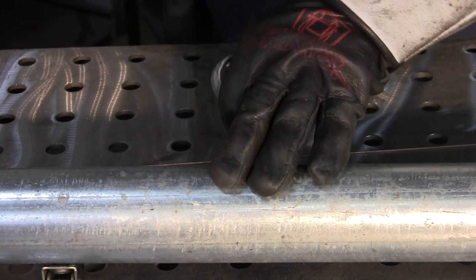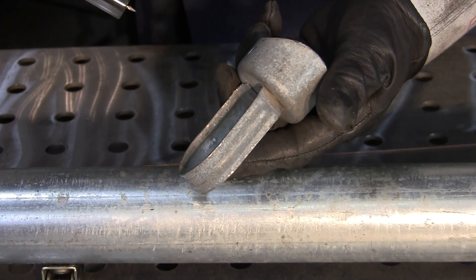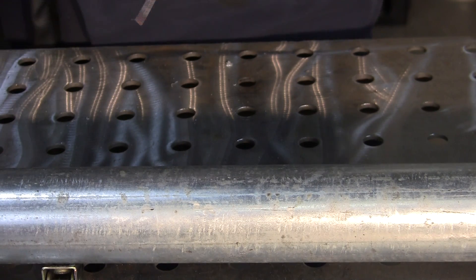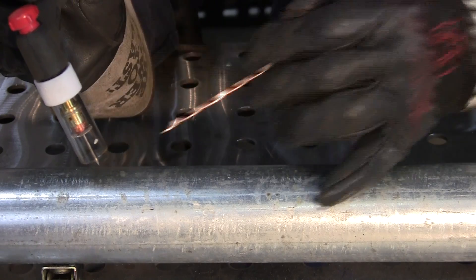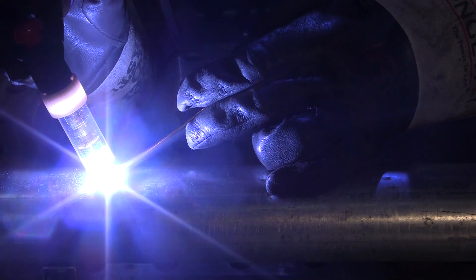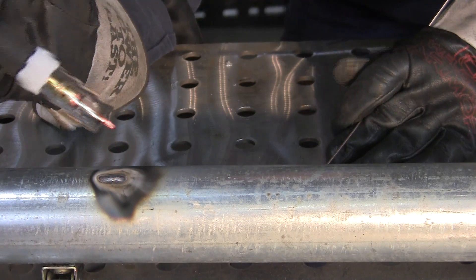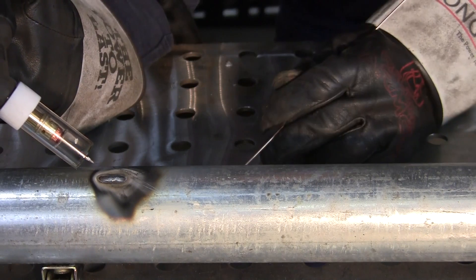What I got here is just some regular two-and-a-half-inch galvanized pipe, and then I got a piece of fence cap — this is always like cyclone fence and stuff like that, and that's galvanized also. I cut it out a little bit so we can fit it on here. First, I'm going to show you what it looks like when you're welding over the galvanized, and how smoky and cloudy it can get, so I'm just using a standard steel rod. You can see how it burns and pops — it'll get milky and you get porosity. See how dirty that gets, and the puddle will want to jump up to your tungsten, so that's not a good thing. Then you get the porosity and stuff like that.